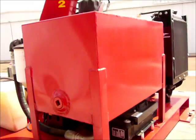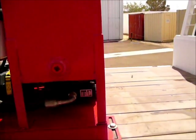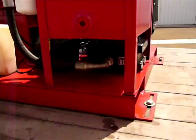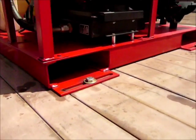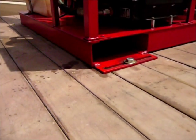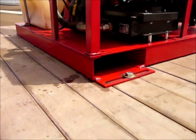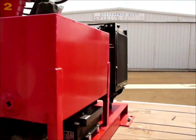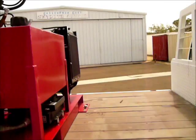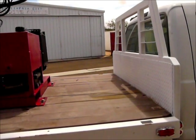This is the cooling system for the hydraulics — very important. Simple diesel tank. As you can see, it's very self-contained. It fits within 48 by 48 inches on the pallet. Here's the view of the pallet. We recommend grade 8 bolts right down into the frame of the vehicle — a pickup or a flatbed. The larger engine actually sticks out a little bit beyond that measurement, but you can still see there's plenty of room for other tool boxes, etc.